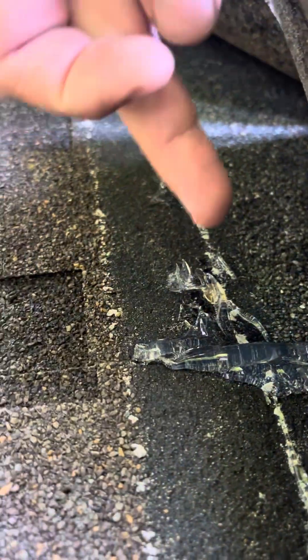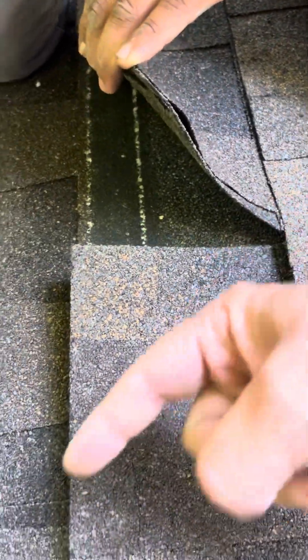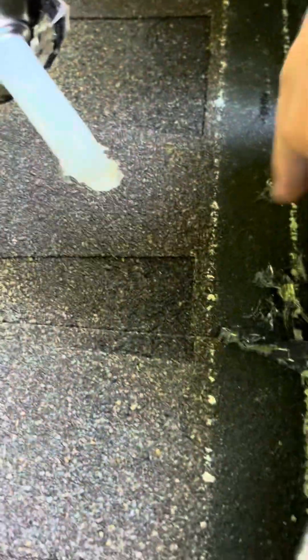What we're doing is we're actually lifting the shingle — it was just a misunderstanding. This is the nail; that's a textbook position for a nail — it's six inches away from where the shingles meet right here. The water can come down here, and the reason it was leaking before is the water was traveling over and landing on that nail right there, and it was leaking.